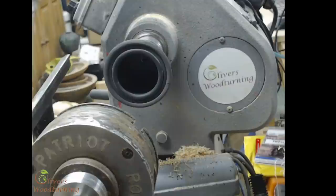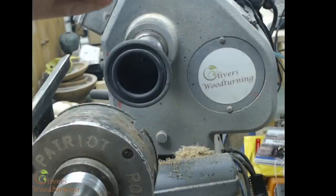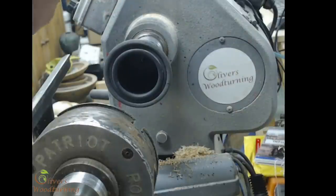Then I had a guy come in to take away the Bambi to service it, because I'd had it a few years and not been serviced. I thought I'd get it all serviced up, a new regulator. And he looked at it, and I said about the cabinet, and he understood, and he said, your cabinet needs 15 CFMs. 15 CFMs? Yeah, a real powerful thing. So I bought off of Machine Mart an Airmaster, and it puts out 14.7 CFMs. It's what I've found to be the most powerful that will run off a 240 volt. Otherwise, you're on a 16 amp supply or three phase. So that's what I've put in over there.